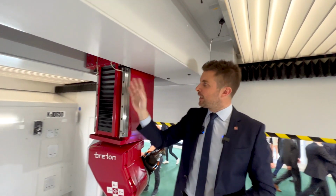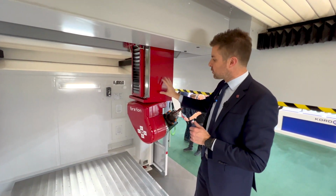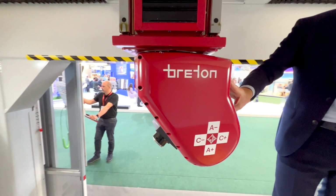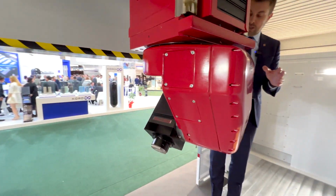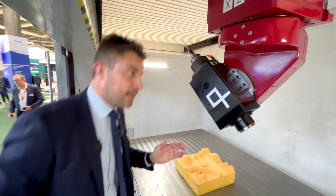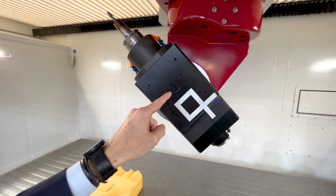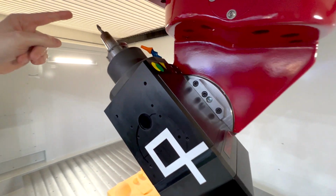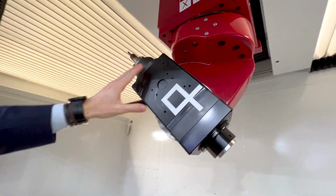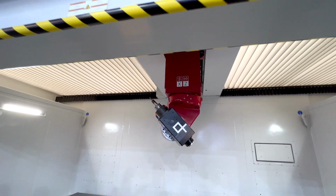Exactly in the middle of the bridge, we locate a ram with a wider section that supports a cast iron solid rotary head, 2 axes on it. And because of the specific design of this head and the offset that we provide in the spindle, we can allow the A axis to reach the important inclination of 135 degrees for all your undercuts and all your works under the 90 degrees.